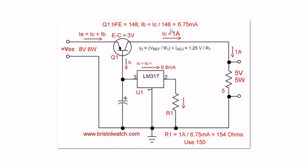If you take the measured HFE of 148 that I had on this particular transistor and divide it into 1 amp, you get 6.75 milliamps. That is, in fact, what I measured at pin 3 with an ammeter. I was basically shocked how close the calculation was to the actual measured result. Note that the HFE was measured at 148 at room temperature, and I maintained room temperature on the heat sink when I made these measurements. The HFE will change based somewhat on temperature of the case, but it also changes dependent on the current through the transistor, as we will explore later on.